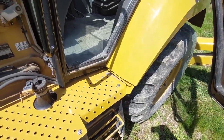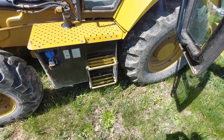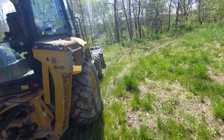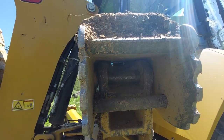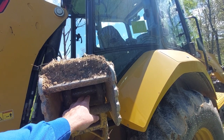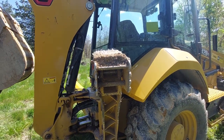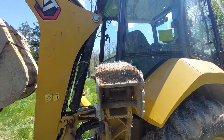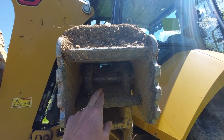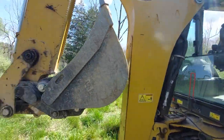I do like the steps for getting in and out — if you bump something on a job site, there's a rubber framework with some give. One thing I forgot about the outrigger: when you're digging, it gets packed full of dirt up in there, and sometimes that gets really stuck — dried out and hard. When you load the machine and go down the road on the trailer hitting bumps, if you haven't cleaned it out, that material can fall out on your trailer or on the highway, which could cause a problem with other vehicles. So make sure the outriggers are cleaned out good before you transport.